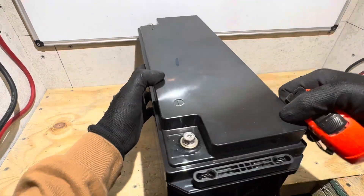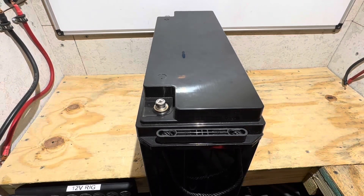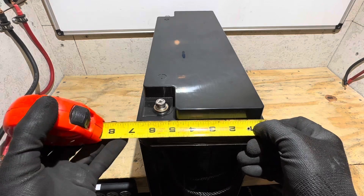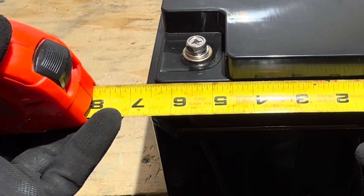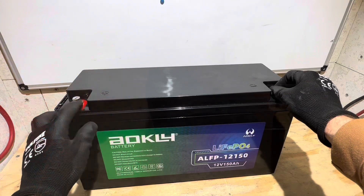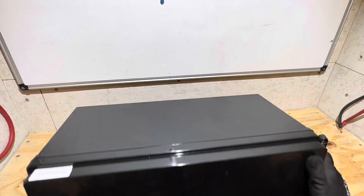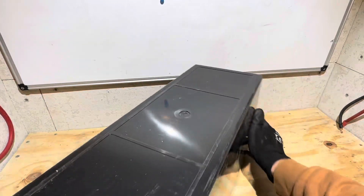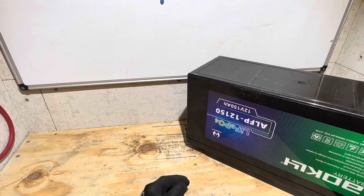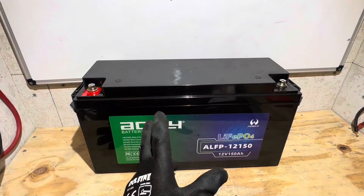Let me get the width — it's a skinny case; you'd think it's more like a 4D, but it's not. It's a good bit narrower than the big 200 amp hour cases. We're right at 6 and three-quarter inches wide — more like 6 and 11/16ths, but close enough. The battery has inset terminals and multi-position mounting, so you don't have to have it sitting upright. You can mount this battery in any position as long as the terminals aren't upside down — that's the one non-approved installation position. Any other position is perfectly fine.